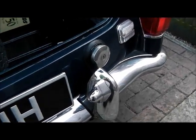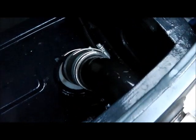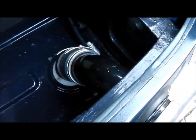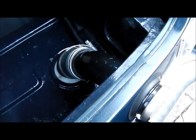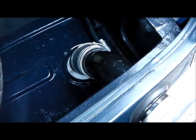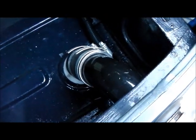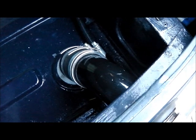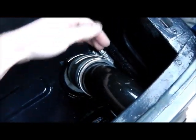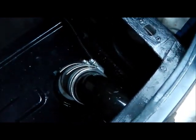While we're on the subject of the fuel system — a few days ago I had the fuel filler neck out and had a look in the tank. It's really clean in there, no rust, but there was a terrific smell of fuel in the cabin — quite a heavy smell, really not pleasant. To start with I've cleaned all this tube, tightened up the jubilee clips, and the smell's now gone.